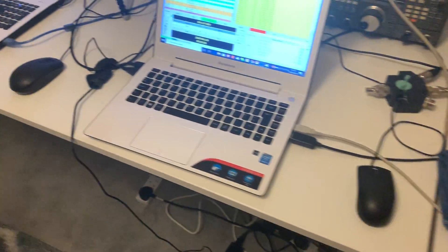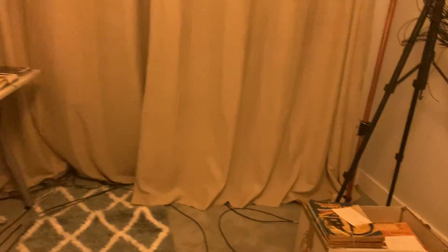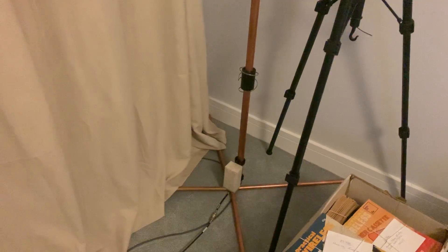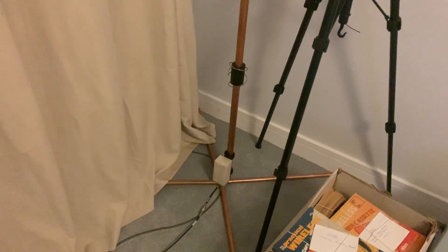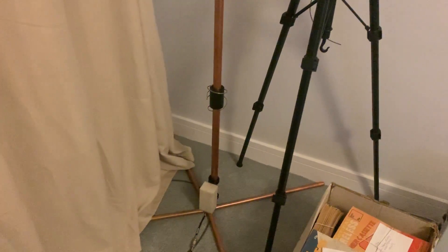So the fact that I'm putting 20 watts into it now and I've been decoded by an operator 20-odd kilometres away — I guess that's reasonable really. More experimentation is required. I need to put it outside and mount it somewhere. It's pretty ugly as collinears go, and pretty obvious, so I'm going to mount it somewhere, probably not very high up off the ground. I'm already pushing my luck with my G5RV that's swaying in the breeze, but my neighbours are really good about it — no one's said anything, no one's got a problem with it. I should set it up outside and see how far I can get my signal.